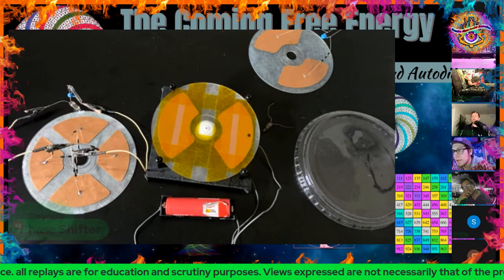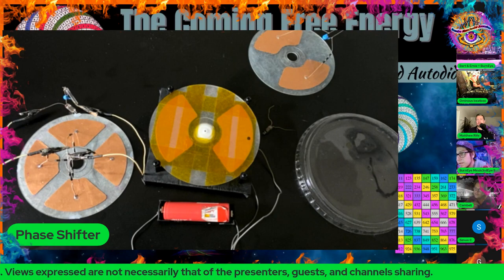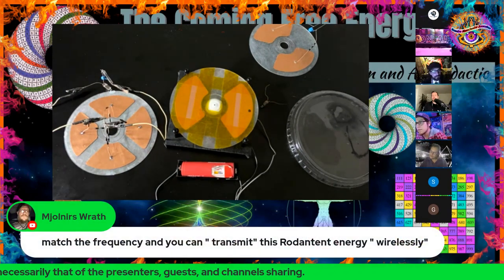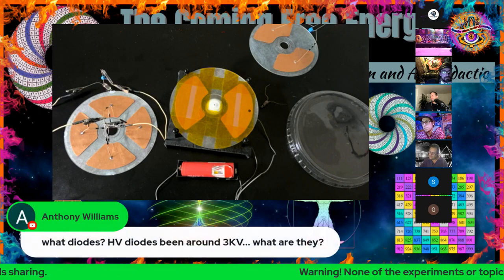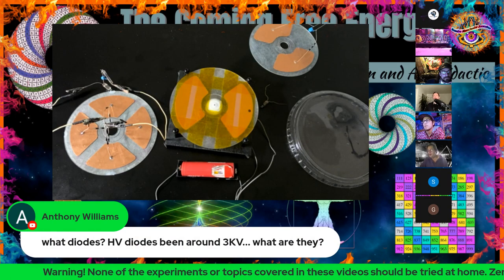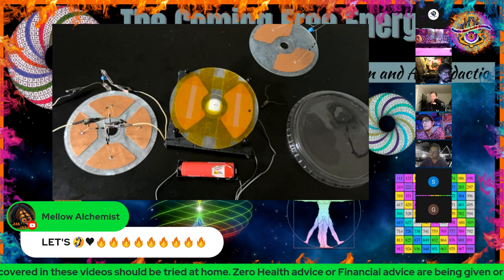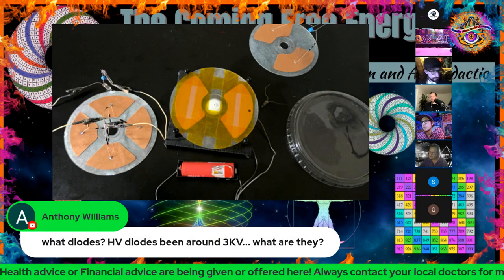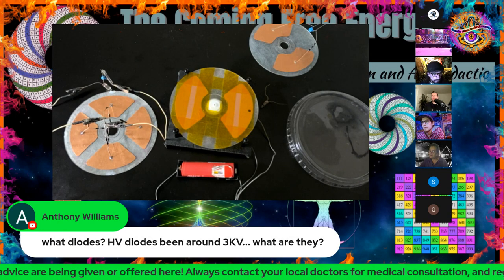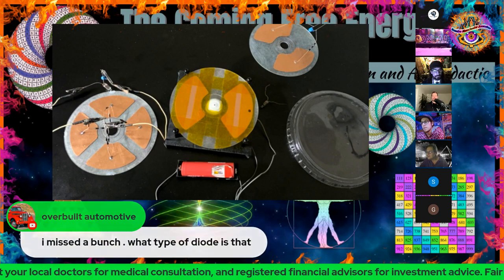Do you think the electrostatics that's being imparted to the disc now is helping with that spin for the motor, like your efficiency? If I phase it correctly, yes. If I phase it wrong, no. There is a way to make the load draw power from the motor. If I phase delay it by 90 degrees, it will draw power from the motor, because then it's going to be very conventional in terms of its characteristic loading conditions. There we can accept 25% loss from the backwards attraction, and we also increase our output current. Right now we're accepting about a 3% loss, which for some reason is not showing up on the meter. It should be, but it's not.